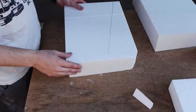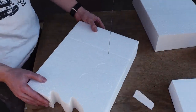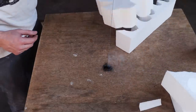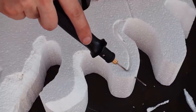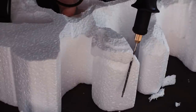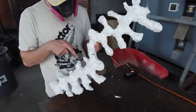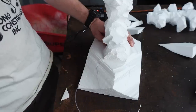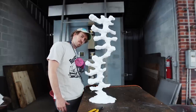I started out with a big block of styrofoam to make something called the pattern. This is a styrofoam version of the sculpture I'm going to make, and then I'm going to make a mold which I will pour molten aluminum into. Styrofoam is nice but I wouldn't recommend it, because even though I was wearing a respirator while cutting it with a hot knife, it still gave me lightheadedness and a headache — the fumes from melting styrofoam are very, very toxic, so be careful out there.